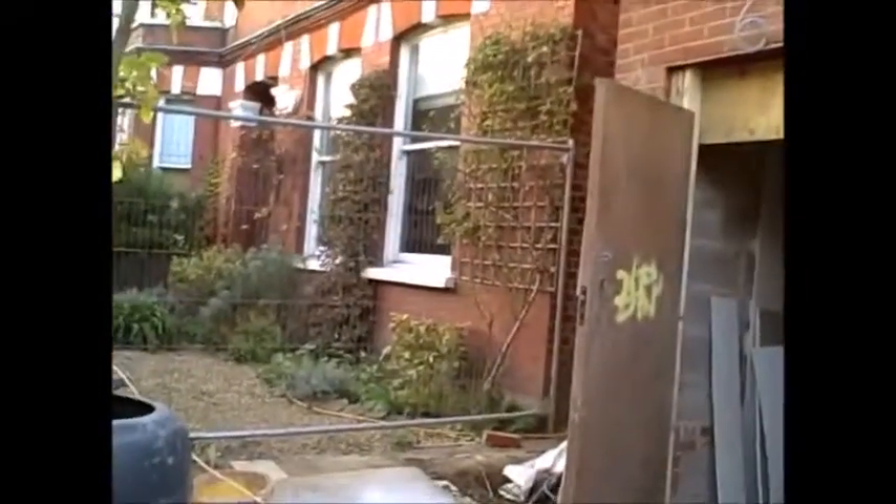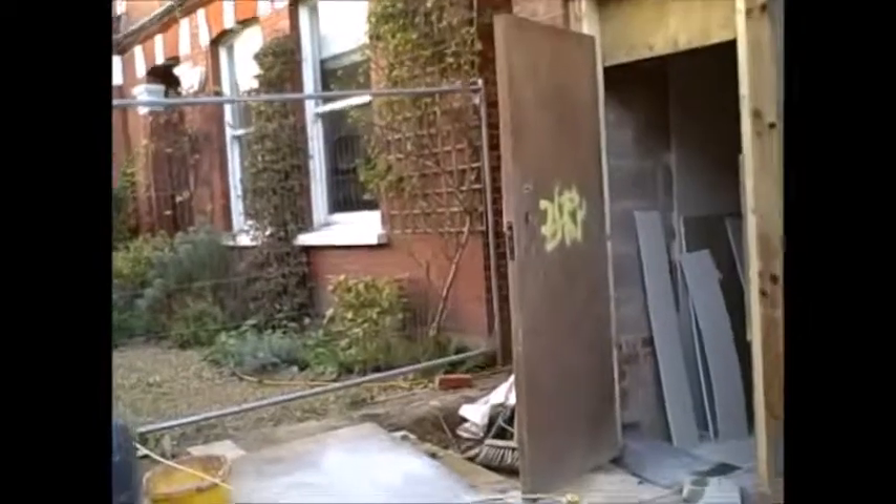What, what bottom bit? The black bit that you have to put on top. Last time in the video you said 3 days. Okay, well maybe. It's dry, but you don't take the supports - it's just a precaution. You leave the supports in there for as long as you can, but 7 days for supports. Concrete dries, gains sort of 80-90% strength in 3 days. I may have said that, but the actual supports you try to leave as long as you can.